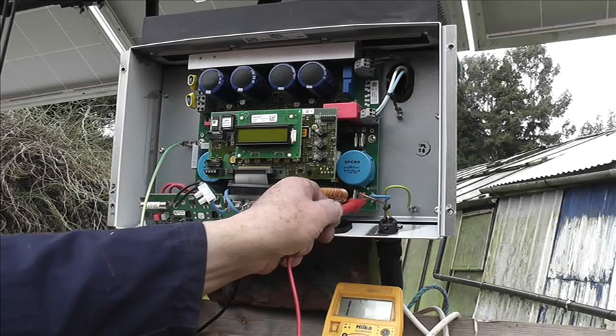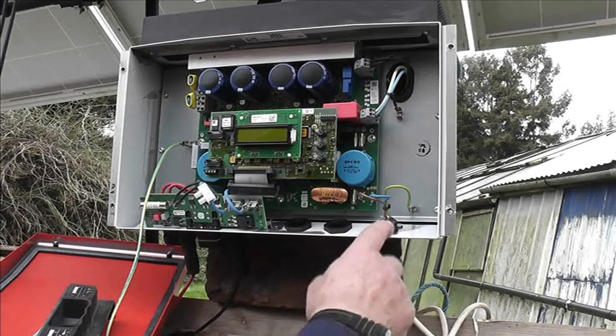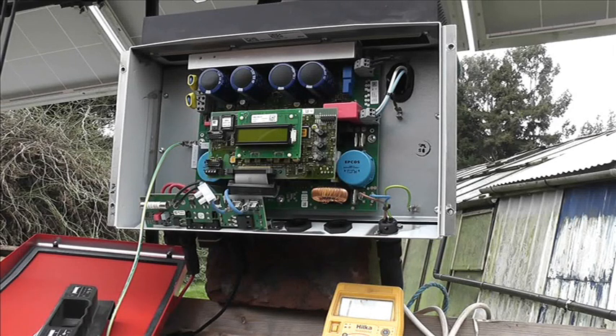There's the live and no continuity, and there's the negative - no continuity. Tried it the other way around - nothing. If the fuse was blown it would just be the live not having continuity, but the negative would. What on earth? We've got grid 240 or 230 volts at that trailing blue lead, but the AC is not getting to here.